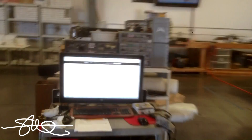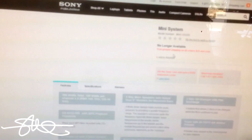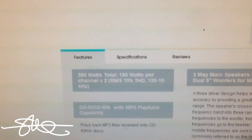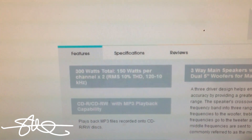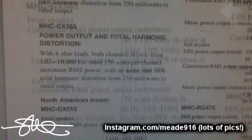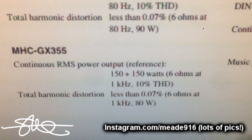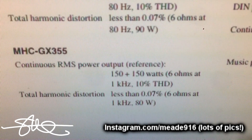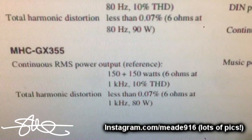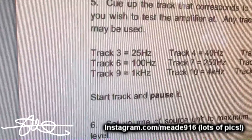I've already had this boom box for about five or six years, so I have no idea how much power it's supposed to put out. But you know me — I pulled it up: 50 watts per channel at 10% distortion. I don't know about all that, but we'll throw it up on the dyno anyways. If you look a little bit further, you can see 80 watts at under 1% distortion, so we can go ahead and run our certified test. If she does 80 watts, it's not too bad. Of course that's at 1000 hertz, and we do have a track for that — we'll use track nine.